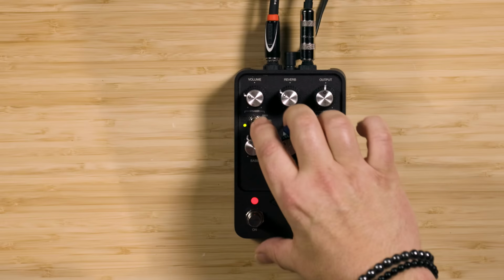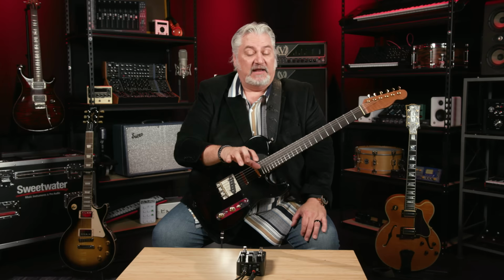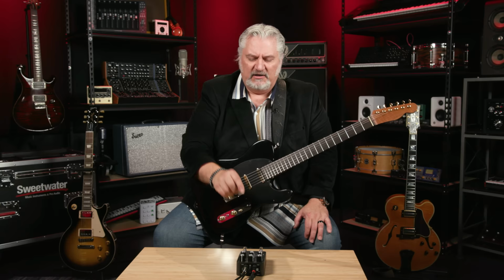And that allows you to run direct into your audio interface for recording, direct into a PA system or an FR-FR system on stage, or we could turn this off completely by pressing again, the light goes out, and now we have no speaker emulation, no mic emulation. The amp is still active, but if you're going to run into a real amplifier, this is a setting you'd want to use with no speaker emulation.